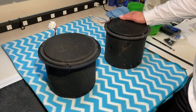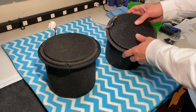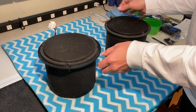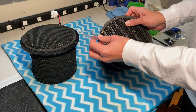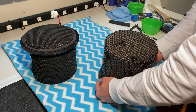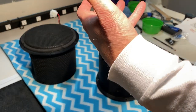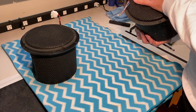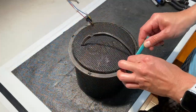Okay, before we install the cans, let's take a moment to compare the original speaker module, with the woofer and tweeter, with the new one. You can see in the original, 4 wires coming out of the can. Now they go, again, this way down into the enclosure. Okay, so this part is facing up and out, this goes down. This woofer fires down into the enclosure. Let's take this apart.